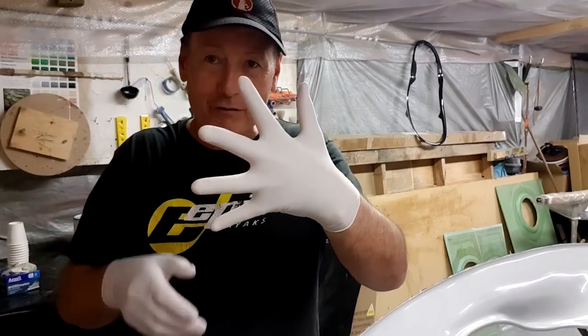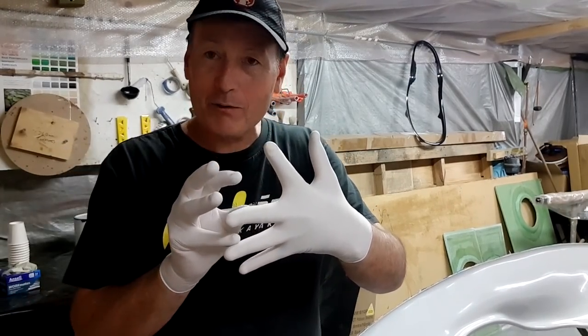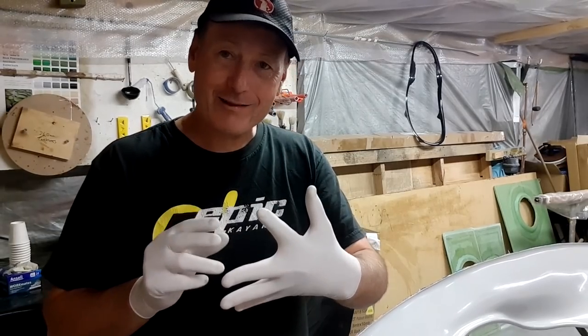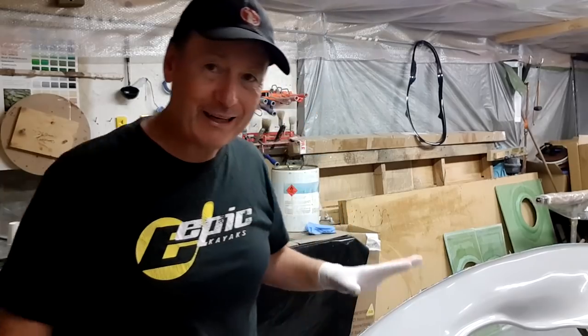1, 2, 3, 4, 5, and your brush and go brush, brush, brush, because what's going to happen then is you're going to blend the black and the yellow together and create a brown and a pretty hideous looking streak or flow or brush stroke through the mould.